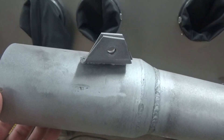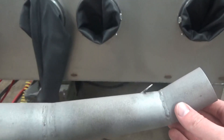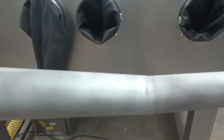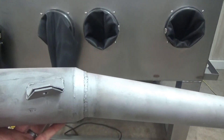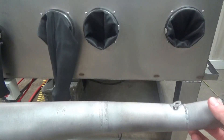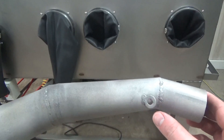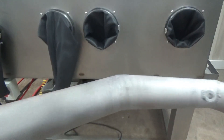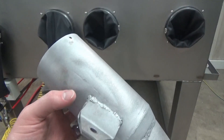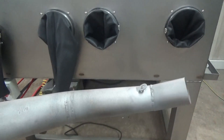If you're processing ferrous metals like we did today, it's best that you run a closed loop rinsing system — that's going to be one of the fully loaded elite models that we have. That way you can add a rust preventative, especially on larger parts such as this. You can imagine blasting one end and by the time you get to the other side, this part could flash rust on you, which is not good if you're going to be coating it afterwards and could wreak havoc later on. You add rust preventative to the machine, and the closed loop rinsing system — which we have on the 4000 — allows you to refeed that water and rust preventative mix back into the machine when rinsing, so you're not losing that water or that rust preventative.